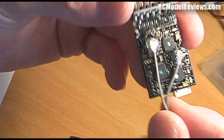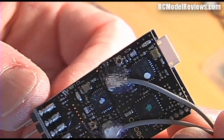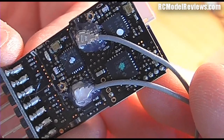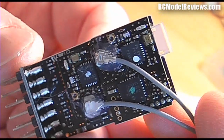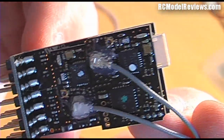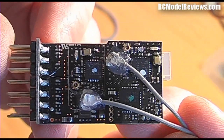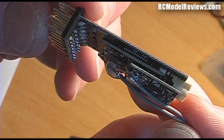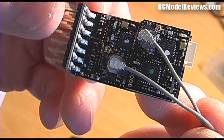It's got a high board count and won't be cheap to make. I'm surprised most other manufacturers have managed to squeeze it all onto one board, but JR have decided to go with three boards - maybe for more flexibility to update and upgrade. On the very top board, we have a Microchip PIC 24F series processor - that's unusual because just about everybody else is using Atmel processors. PICs are not often seen in RC gear. And on the little RF chip, this is the TI CC2520, which is used by a lot of manufacturers. I'll look up the data sheet in a minute to see if it's the same as used by others.